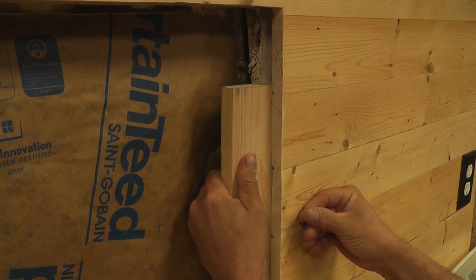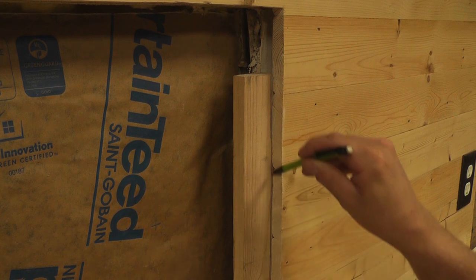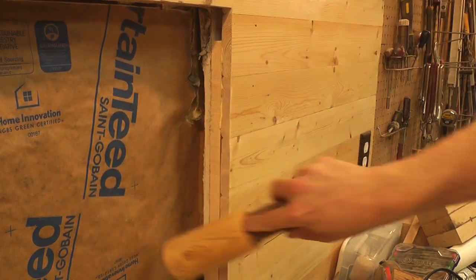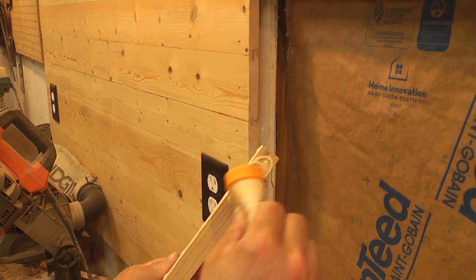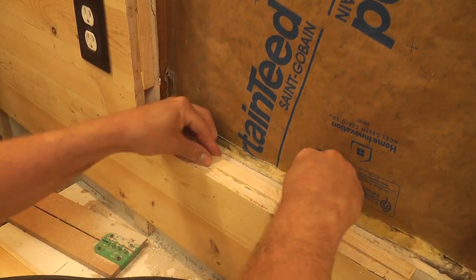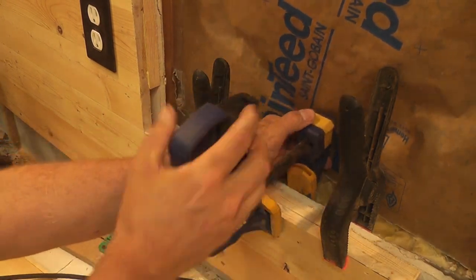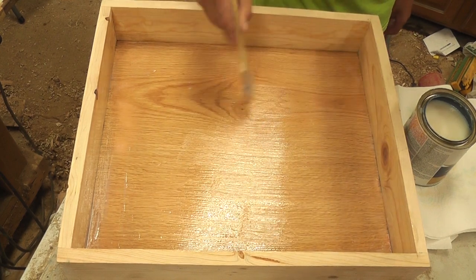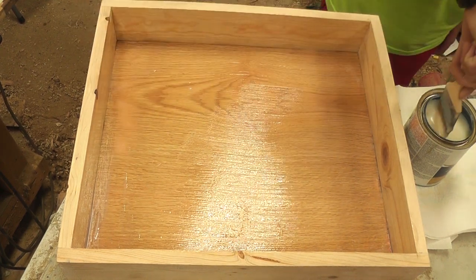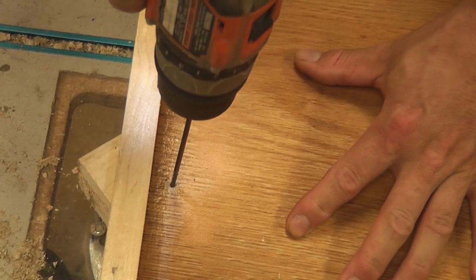What I'm doing here might not be so obvious. In order to attach my cabinet to the wall, I needed a surface to attach it to. Behind my new cabinet was just insulation while the only thing I had on the sides was drywall. Adding these boards was crucial in that it gave it a surface to adhere to. My son is adding a couple coats of water-based polyurethane and finishing the back because we'll be adding magnet tool holders. Due to the thin wall of the plywood backing, we'll need to use bolts to attach it instead of screws.